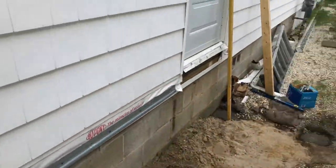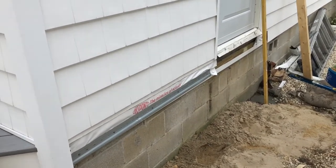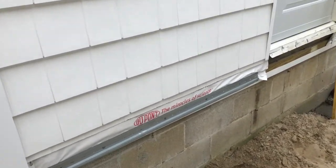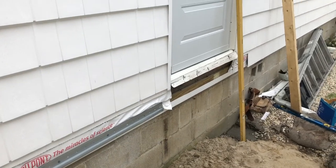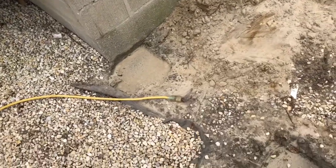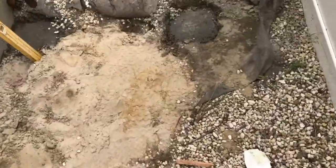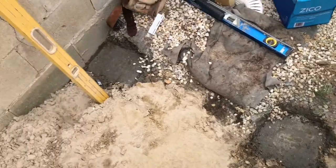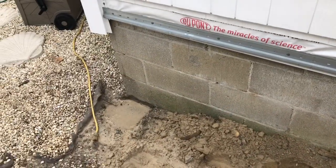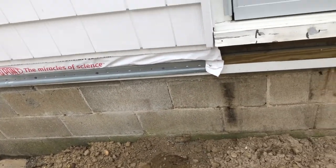Building a deck here in this spot today, and had a small one. It's been sided. I've already cut back the siding from my ledger board, and I already have the footings in. Footings go down about 3 feet, except for the ones up by the house, they go down about 2'6", and then they sit on top of the footing from the foundation, or the foundation.